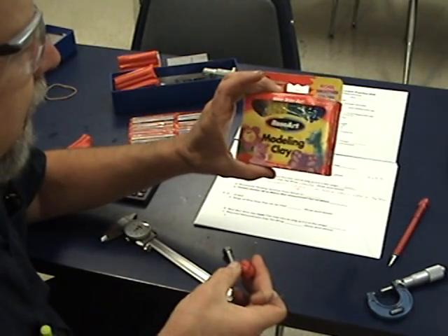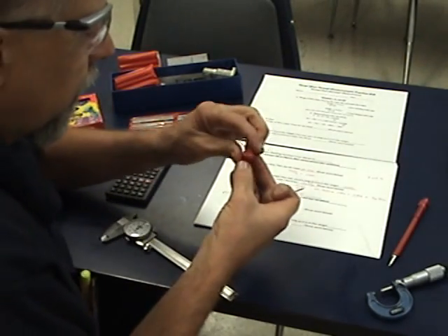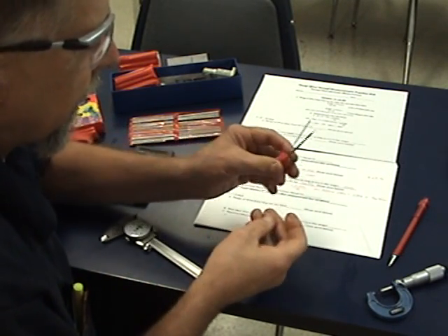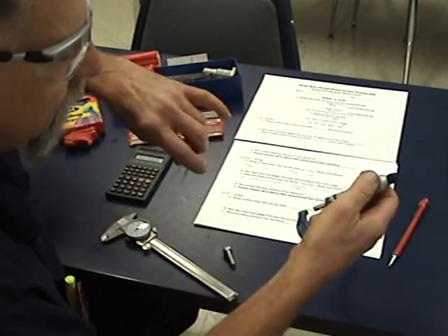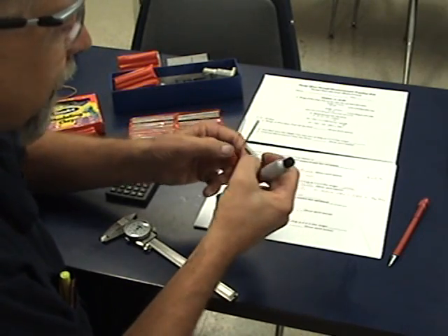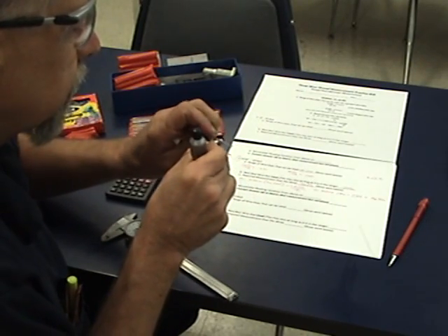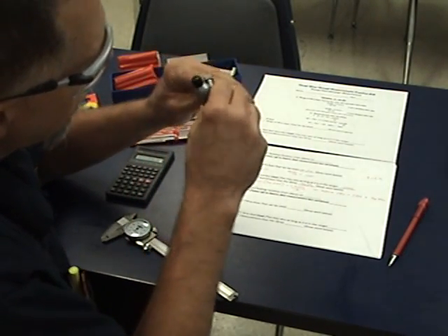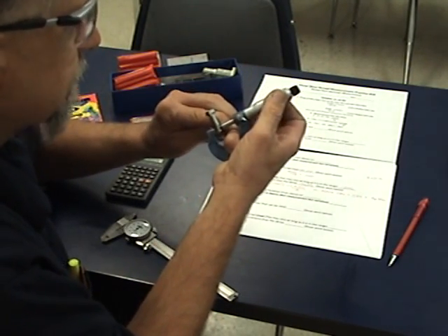This is just regular modeling clay — I think I got it at Walmart. We stick one wire on one side and the other two on the other side, just like that. What's critical is that I want my spindle over the double wires. Remember from when we studied the micrometer: this is the spindle, this is the anvil. I want the spindle over the double wires — it's a little bit easier that way. So I'm going to put my wires over my part, making sure the bottom one is in the middle. Now I'm going to take my micrometer and get my measurement over the wires.